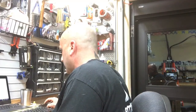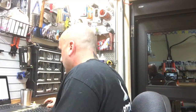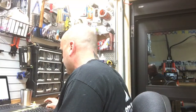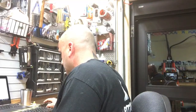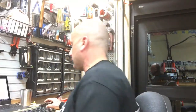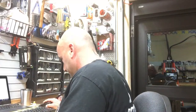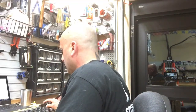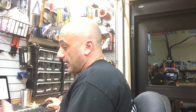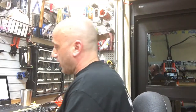and we're going to go to the one that gets our KV reading. So we're going to do a measure KV and make sure that everything is dialed in for this, and it'll automatically run this test for us, and you guys hopefully will be able to see that on the screen. Okay, so we're going to give this a shot and make sure first. So let's go ahead and do that. And it's going to ramp it up. You have to ramp it up without a prop to do this.